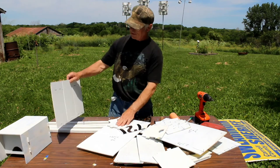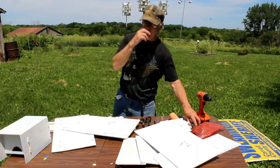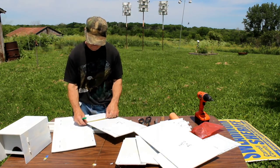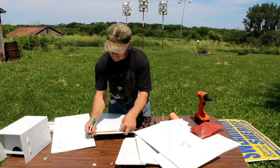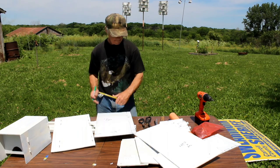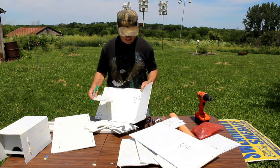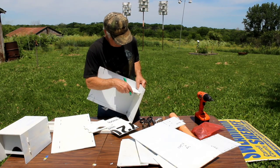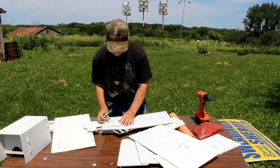Here we've got the house. Like where we bent this one, we've got to mark it off where we're going to put these tabs. I normally set the back end in a half inch and I normally set the front end in two inches. That'll leave you a seven by nine inch compartment when this is done. You can see I've got these pieces here. You can make a pattern where you can mark these all out. Initially on the first one, I normally just set it right up there like that and mark it here where this thing goes.